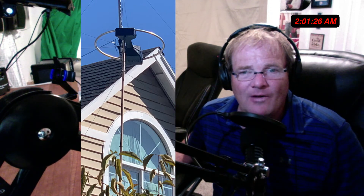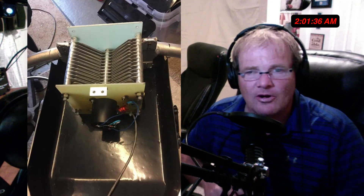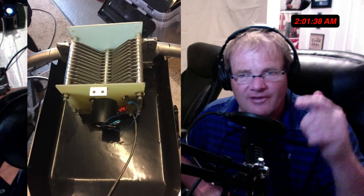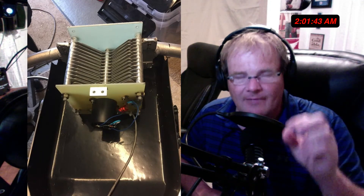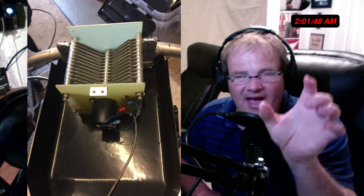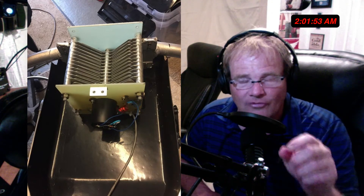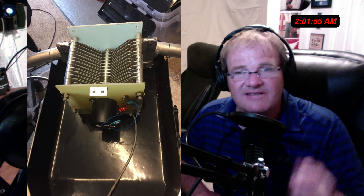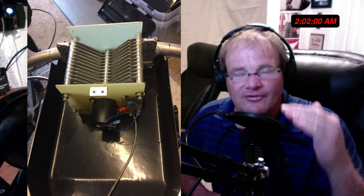This is the best loop I've ever used because it's a receive and transmit loop — it does it all. How it works is very simple but very cool. It uses a butterfly capacitor, essentially a variable capacitor run by a motor at the bottom of the capacitor body. You can see it with the blue wires coming out. Part of the capacitor fins are attached to the housing, and the inner fins rotate. The motor rotates those to get you to your best SWR reading.